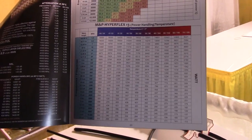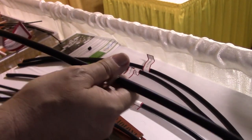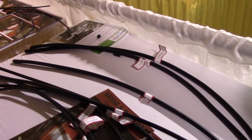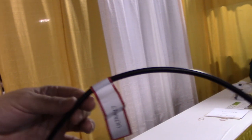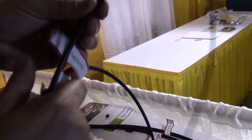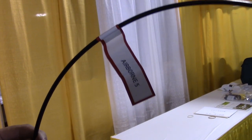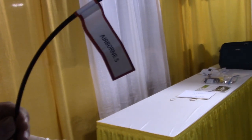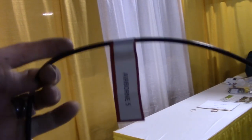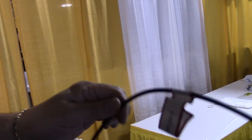For people who want something for a mobile environment or prefer a smaller cable, we can go back to the 0.300-inch cable we discussed earlier, or go to something like Airborne 5, which is the same size as RG-58 - extremely light and very well performing. It's also bendable. If you want something much more flexible, there's Hyperflex 5.